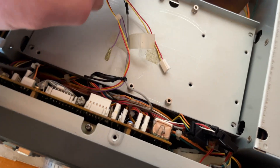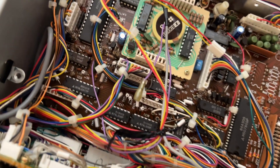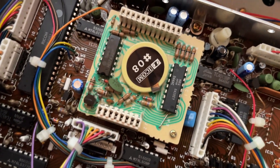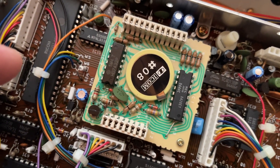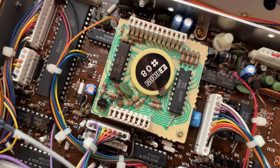This is the bottom cover removed — you just need to undo four screws, which I've already done. Lift it up. There you can see the offending old RAM board. This battery here goes very, very low and will lose your RAM — basically lose all the programming for the receiver. So this is the board we need to change. I'll unplug it, plug the new one in, and we'll give the receiver a test.